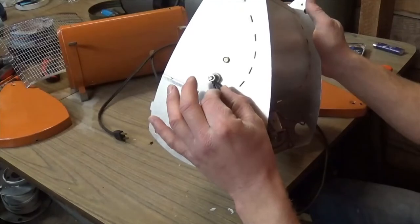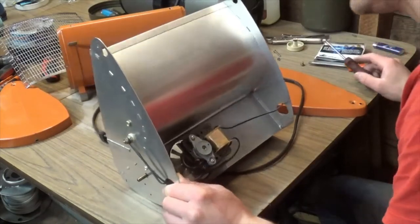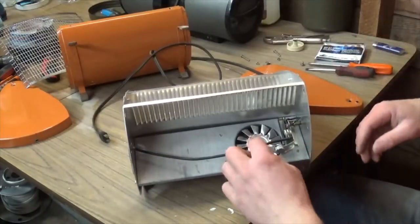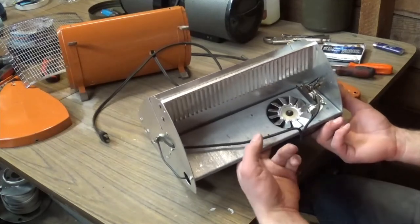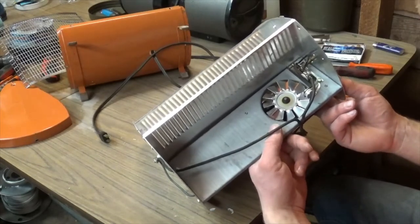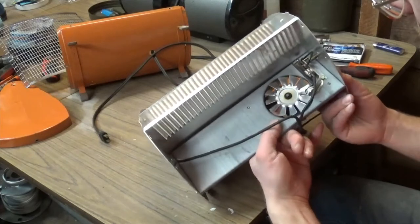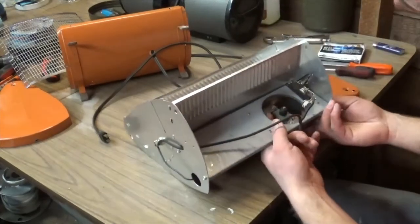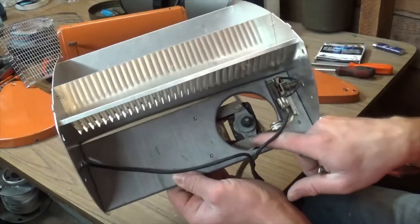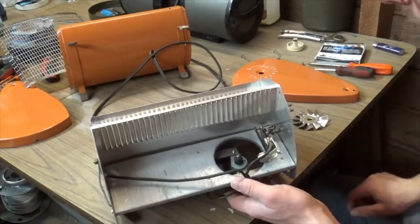You can see the fan just connects right up with the heater element up here. In order to remove this fan motor from the heater, I should just remove it, but it seems I've got a nut on the other side that won't let me unscrew the screw. In that case, we have to gently get this fan blade off. The best way to do that is to reach from behind with your fingers, get your fingers up underneath the center hub of this fan blade - don't push on the blades or you'll bend them. Now we loosen the two nuts that fasten the motor onto the heater.